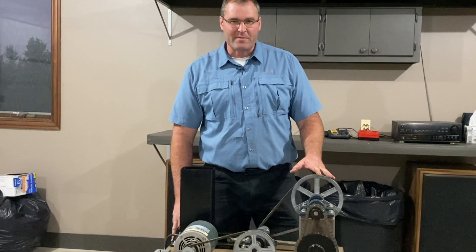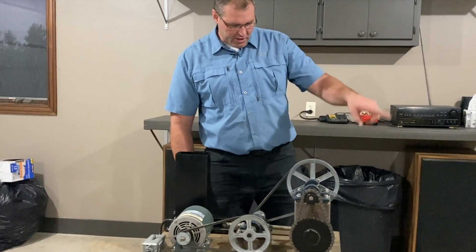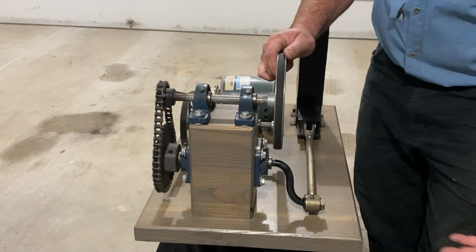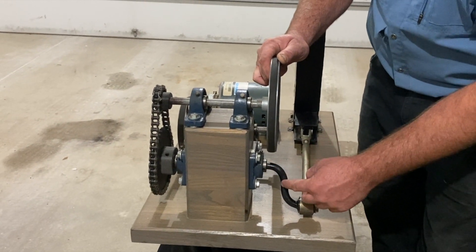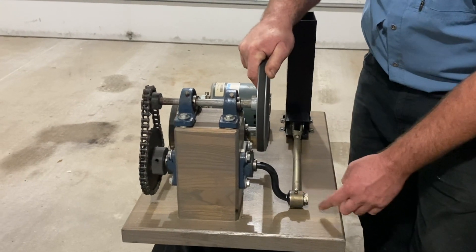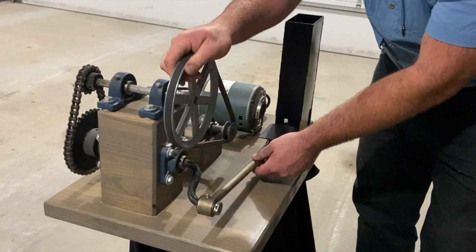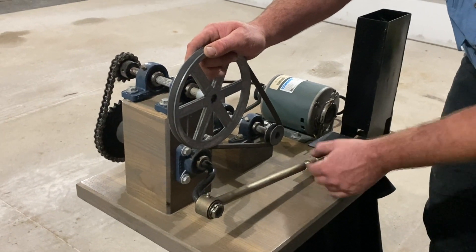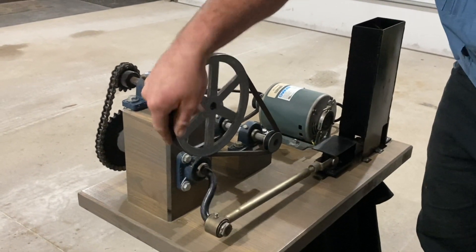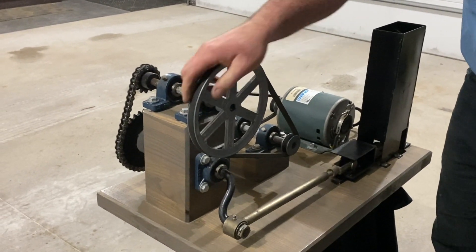This is all made of hardwood — the platform — and we used pillow blocks, half-inch rods, a couple of belts, and a chain. I got this half-inch solid steel rod and took a torch to it, slowly bent it to a perfect 90 degrees, then bent the other end to a perfect 90 as well, and put a grease fitting on there with a nut and cotter pin. Over here I had an adjustable rod from an old tractor I used to have, and I rigged that up so I could adjust the depth of the plunge to decide how much I wanted the can crushed. The linear slide is a ball-bearing mechanism I bought online that keeps everything running straight.